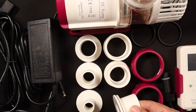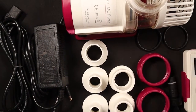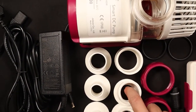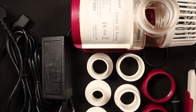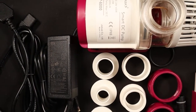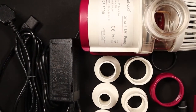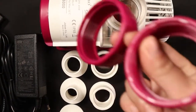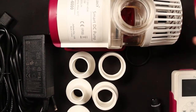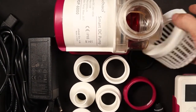It comes with a 3/4 inch, 1 inch, 1 1/4 inch intake for your plumbing purposes, which the 3/4 inch and the 1 inch adapter you will require to make use of the O-ring over here, like so. And then you will use this cap to actually tighten it. What is interesting though, the two pieces down here can actually be fitted either on the top or over at the front once we remove this piece over here, like so.